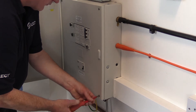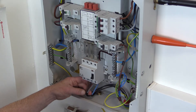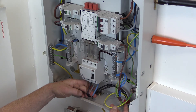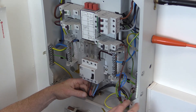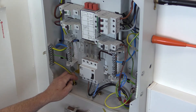So let's now take a look at the test rig that we're going to use for this demonstration. From a visual examination of the test rig, it's supplied by a flexible cable taken from a three-phase and neutral supply — TPNN AC supply. The supply cable provides a connection to earth using a separate protective conductor, so it would be regarded as a TNS earthing system. The earth fault loop impedance and prospective fault current will need to be determined by test.